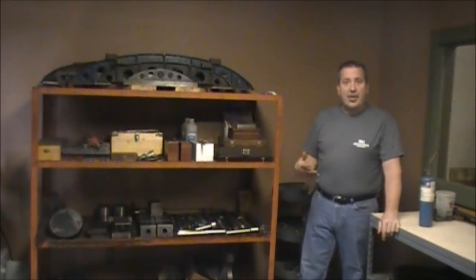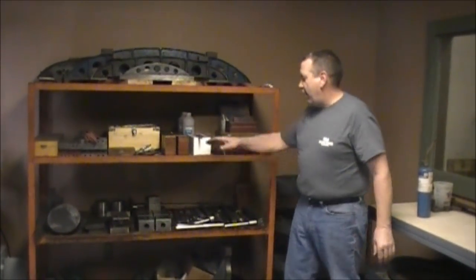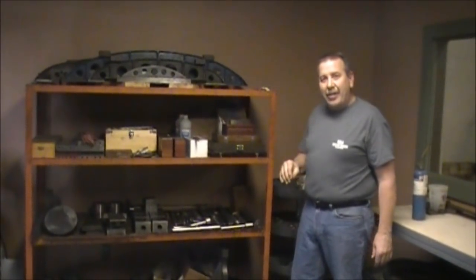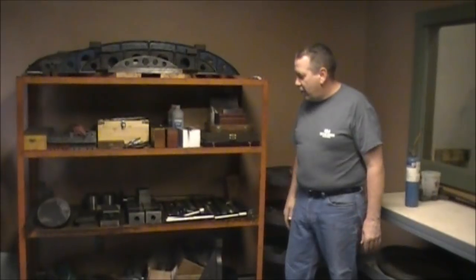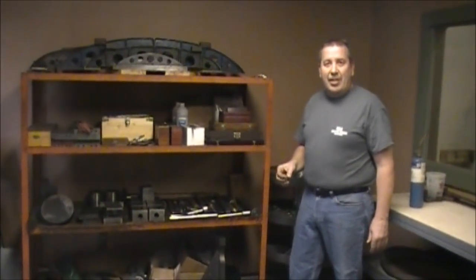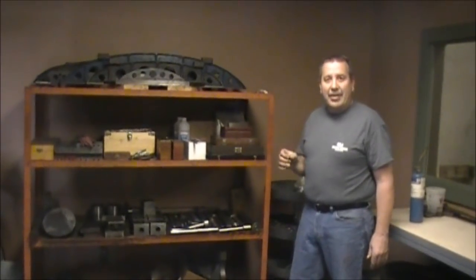Here's one of the last things we need — all the equipment we need to check stuff. Really, the art of scraping is checking. You've got to be able to check whether you're doing a mill, an OD grinder, a surface grinder, a shaper — it makes no difference, you have to be able to check it. We have precision levels, four V-blocks, a 60-degree V-block, sine plates, three sets of gauge blocks, Turcite back here. We've got checking arbors — whether we've got a Morse taper, a Jarno taper, we've got a checking arbor for it. Parallel cylinder squares, eight blocks ground the same size, a 30-degree and 60-degree block for doing an angle head on a grinder. Checking of the machine is the key to a good scrape job. Scraping you'll learn quickly, but being able to check and know the tolerances of the machine is what makes a successful scrape job.